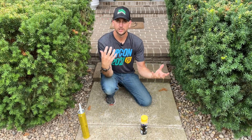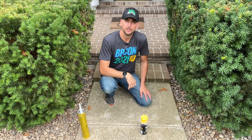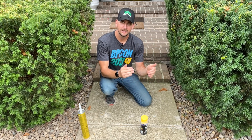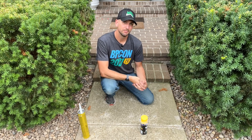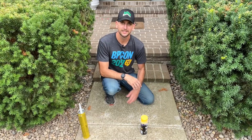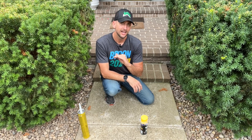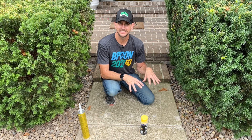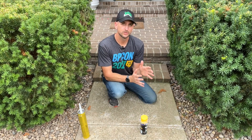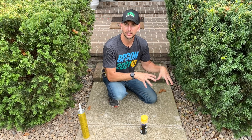There are pro services that do poly jacking using a two-part polyurethane foam, and mud jacking using a concrete-like slurry pressed below the slab. My results were a bit mixed — within about one day the previously leveled sidewalk sank back down about three quarters of an inch. The Vulcan 45 semi self-leveler with sand on top still looks great and is totally sealing the crack. One thing I learned: this had direct sunlight on it on a 92°F day, which caused small bubbles to form. I'd recommend shading your sealant as it sets up on hot days.